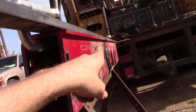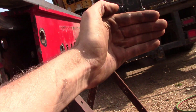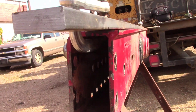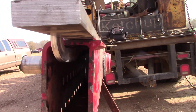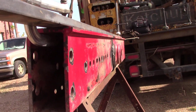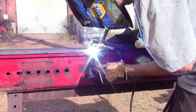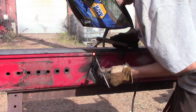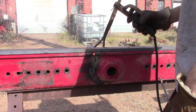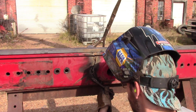I'm going to put a good heavy tack up here. We're going to use the wedge technique - I'm going to weld on a dog and then try to wedge it out this way. Hopefully it won't pull anything too bad out of straightness. That looks really good; I'm going to tack it right there. Just letting you know what I'm doing. This dog may not be strong enough, so we're going to try it out.